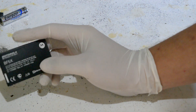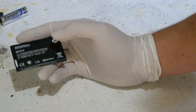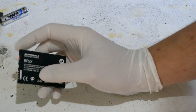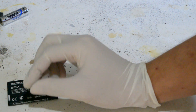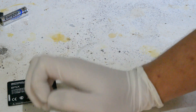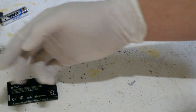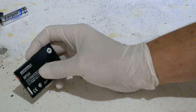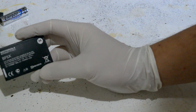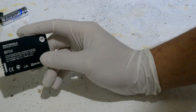You could argue that there are higher charge density ions out there, such as beryllium, but there are quite a large multitude of subtle reasons why lithium is a lot better. Mainly because it's a single point charge, whereas magnesium or beryllium have two charges and they're not equally weighted in terms of the electrochemistry. Plus, beryllium is a terrible element — they wouldn't put beryllium in a home device because it's just too toxic.